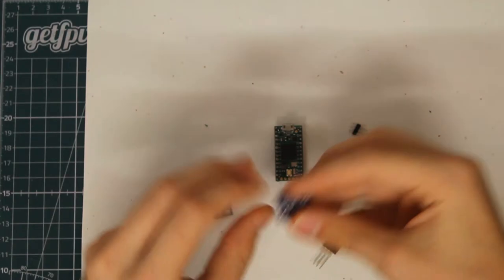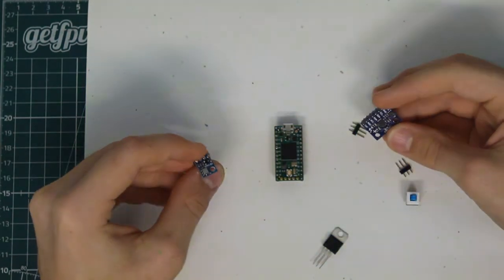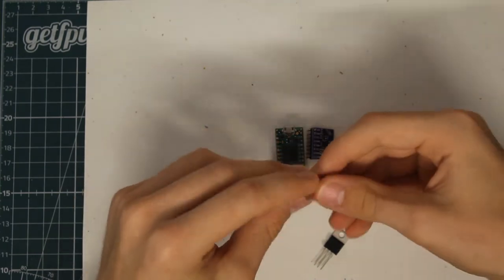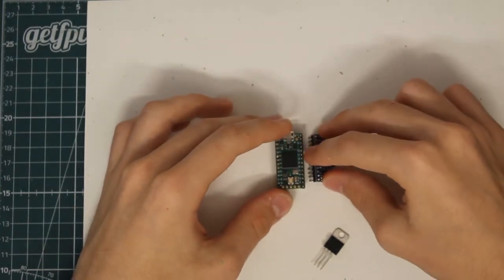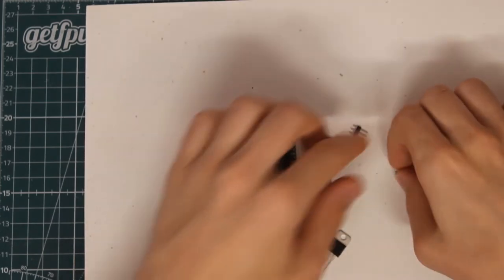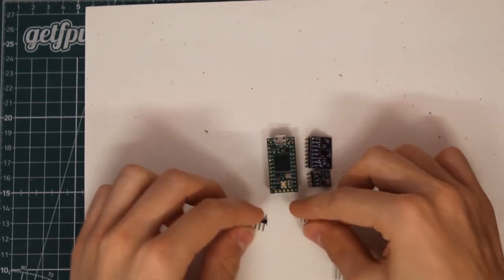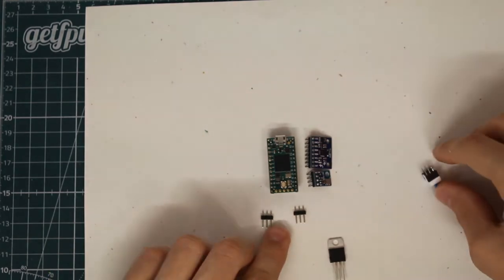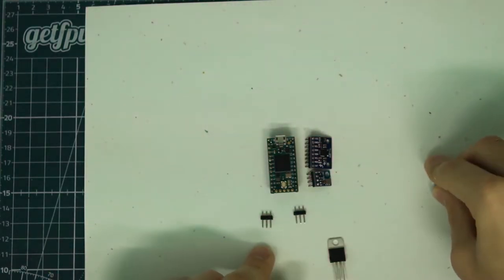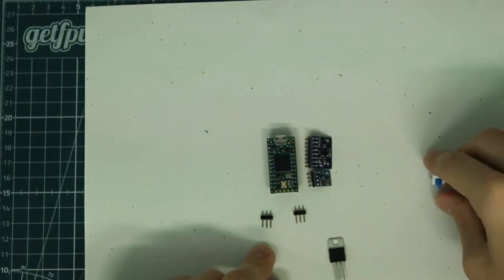We're also going to have a gyroscope and an altimeter. The main goal of this flight computer, or the design, is to connect these two sensors to the microcontroller and then have a few outputs from the microcontroller, mostly having to do with the servo headers that will let us control our thrust vectoring mount.